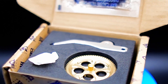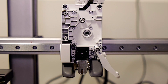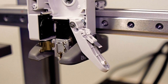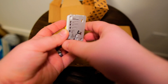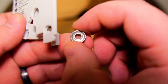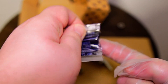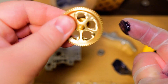This plastic idler arm will also be replaced with the aluminum version included in BQ's hardened gear kit. Here's a quick look at the insides of your extruder unit. I'm now going to replace the cutter blade using needle nose pliers to hold it in place so you don't cut yourself doing it bare-handed. Get yourself some latex gloves or find a way to apply this molybdenum sulfide grease to your extruder gear. You don't want to overdo it as grease will spread out naturally over time.